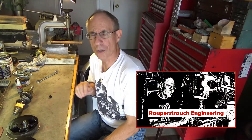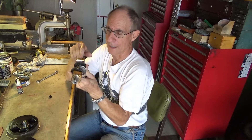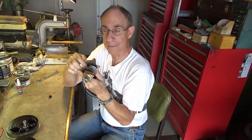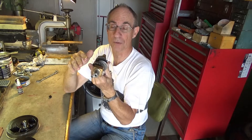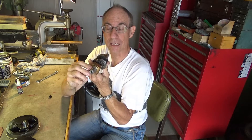We're working on the Chloe that Bob's trying to restore, so let's get right to the issue at hand. Welcome back to my shop, courtesy of Stan. What we're going to look at today is a slight challenge that many of us in this scale happen to have. When you're machining your parts — this is a part, and this is an axle, a second axle of two on the Chloe — it happens to have some eccentric cams that operate the valve gear. The interest in today's dialogue is what we're doing with these ends of the axle. It turns out that this axle is just a piece of simple bar stock that's machined with the axle ends on it, which is a key and carefully measured diameters, and that's where the trouble gets in.